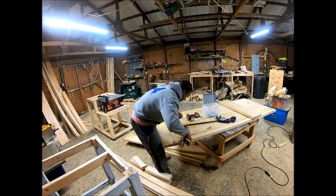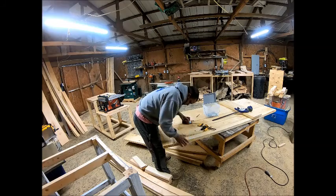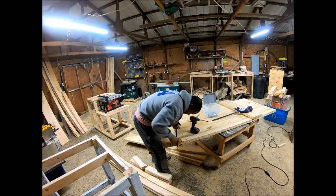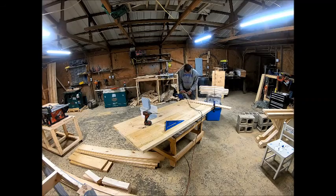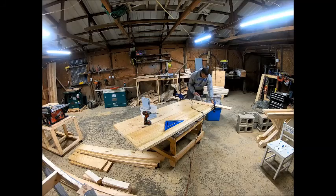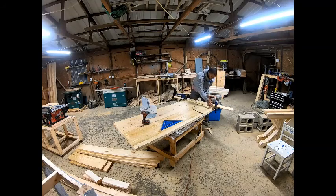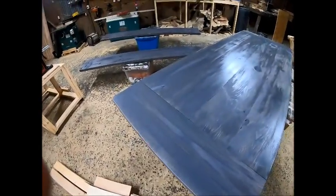On the other side this was something new I started with this table. Usually I just cut the boards at the length I wanted and trim off any small edge, but here I cut it about an inch longer than needed, then clamped down a 2x4 marked with a square and used a circular saw to cut off the edge to make sure everything was nice and flush. The table finished after I flipped it over — I applied a classic gray stain with Minwax, and you can see how all the joints are nice and square together.